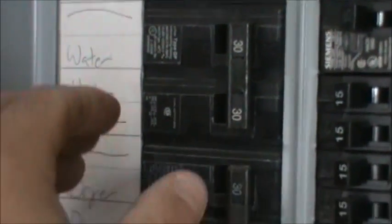First thing we want to do is turn off our power to the water heater. It's a double 30 amp breaker, which is correct for a 10 gauge wire. I'm also going to double check that our power is off at the water heater using my meter, checking both legs just to make sure we're safe. We have a total of about 2.6 to 2.8 volts — that's basically nothing, so the power's off.